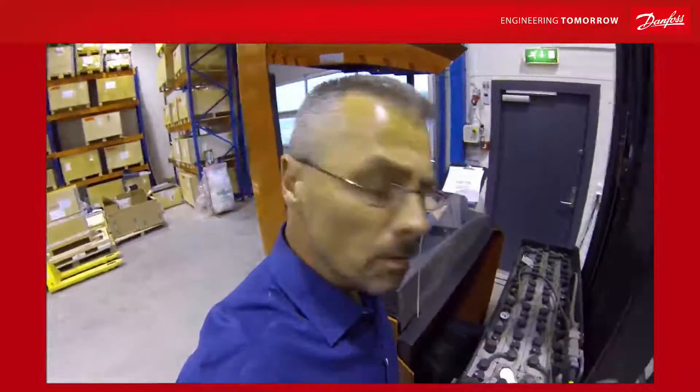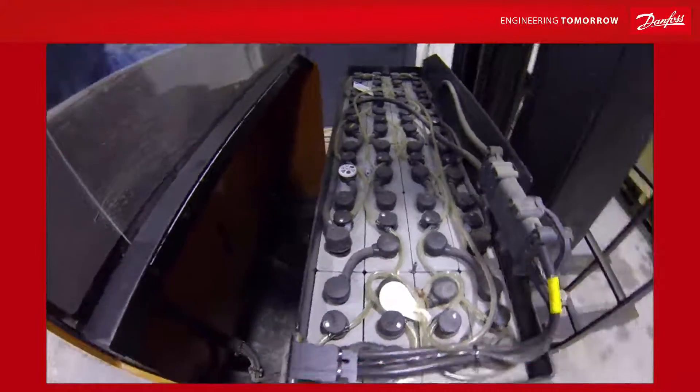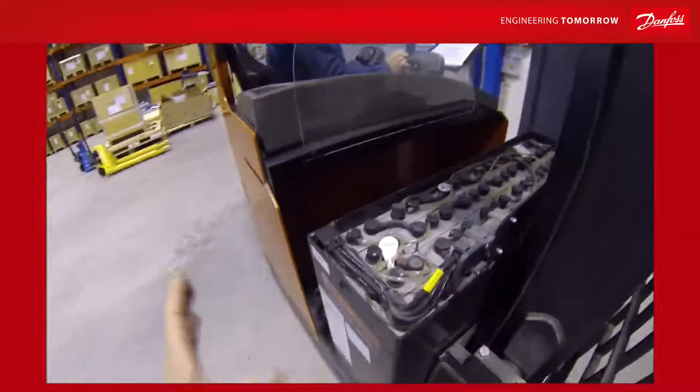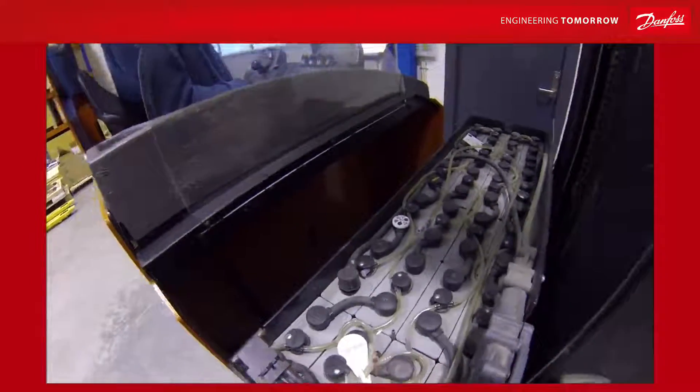Since the DC to DC converter can utilize any battery voltage, most factories have a battery available in their forklift trucks. So this actually could be the energy source for UPS for a small factory.